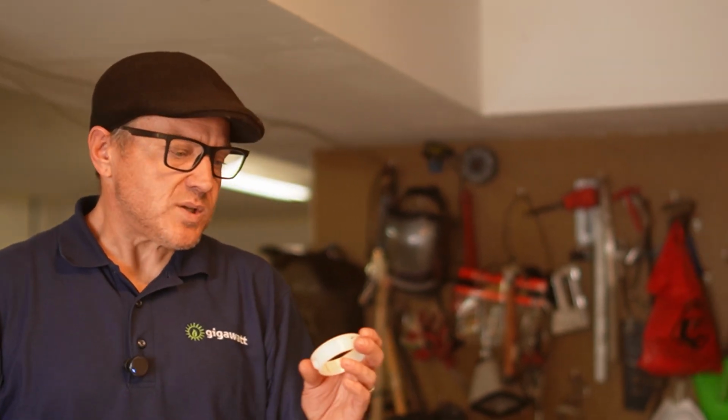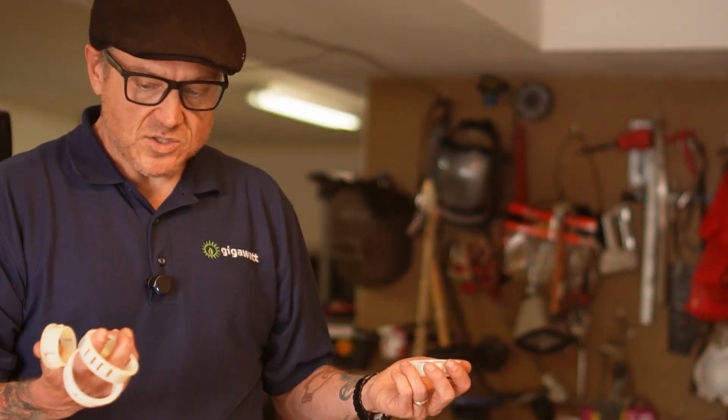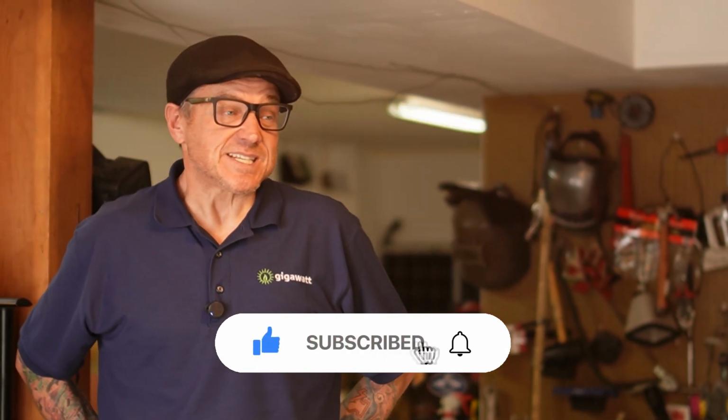Right, exactly. So this allows us to attach our gutter onto the inverter without purchasing any conduit fittings. We've got a punch tool for making knockouts. We've got the template that came with the inverter, and so be sure to subscribe so you get to see us do this next time. We're going to make a custom knockout gutter for the MidNite All-in-One inverter, but really, it would be the same procedure for any transformerless inverter to hang a gutter onto the bottom of it, matching up the knockouts and making sure everything lines up.